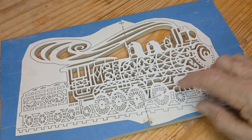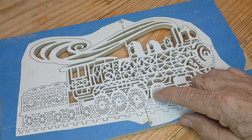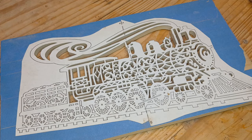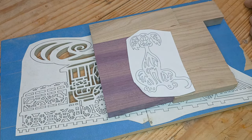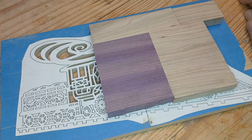Plus the fact that you can't drill a big hole in here. The smallest drill you can use for a number 5 is the number 60 — that's a wire gauge number. Those smaller bits are designated going into the 60s, 70s, 76, different numbers, but I use a 60 almost exclusively because a 5 will fit through a 60. I got into that habit making bowls, trying to use as small a drill bit as I could and still cut three quarter inch wood. So I would not hesitate — if I had a thick, dense piece of wood, say three quarter inch purple heart or cherry, and had to cut a small area — I wouldn't hesitate to use a 1 or a 3. But I should be very careful in how I cut it, and generally don't get smaller than a 5 on something like this.